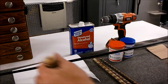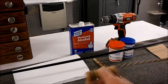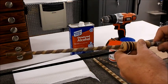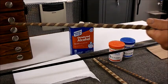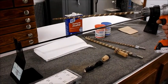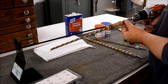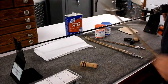Before I started this video, I took the liberty of running these reamers through a little bit to save on some time. I started off with the smallest reamer and ran it through all the way, then went to the next size up and ran that one through just about all the way. So we'll start there. What we're going to do is chuck this reamer up in my drill. I've chucked the reamer up and this being the end that's going to go to the base of the rod, you put that in first — that's the fatter taper, and the rod tapers from that way.